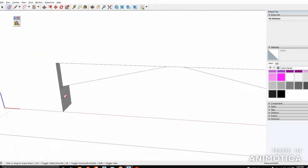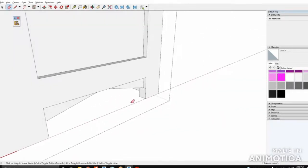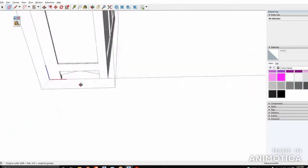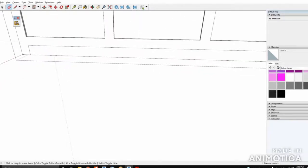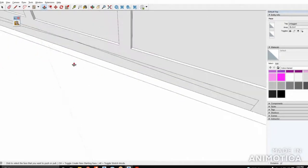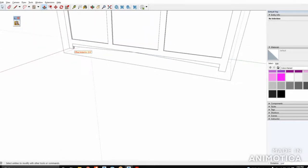When I make these in the field, I actually just take my bottom piece here, that stretcher, and I cut it at an angle, and whatever it ends up at, that's the angle I go with, because then I have 2 pieces already made. You gang them together at that point, and you can flush trim them, sand them, plane them, whatever the heck you want to do.